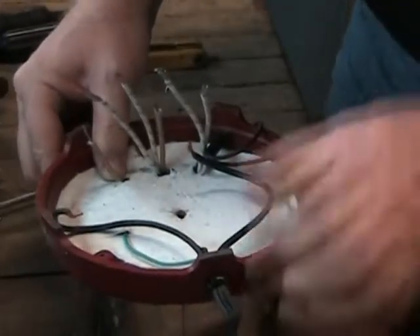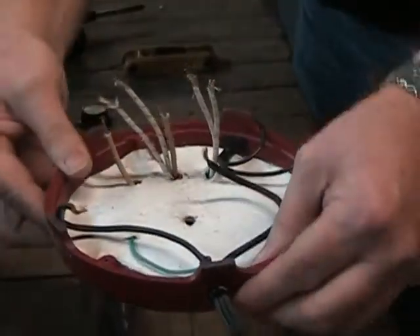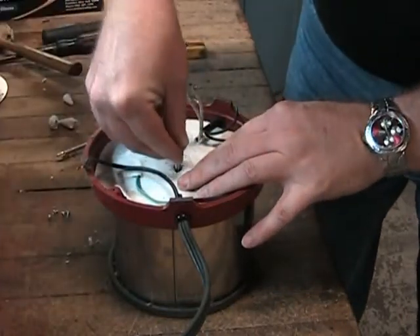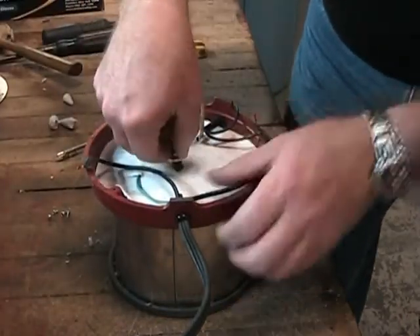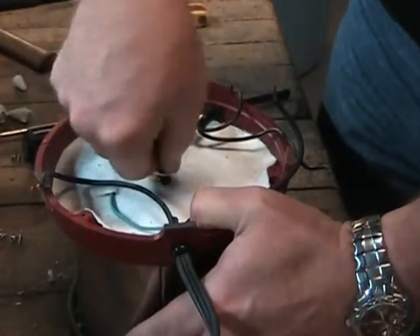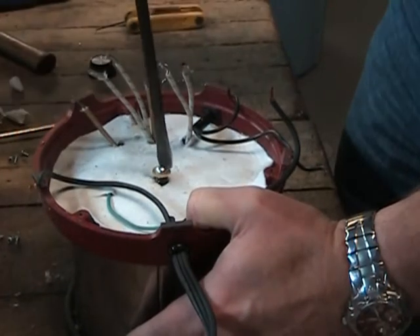Next you should verify that the lead wires have been fully drawn into the base holes and make sure the base is properly seated onto the casing ring. The main assembly bolt, including the spacer washers and tensioning spring, can now be put back into place. It is best to begin tightening by hand to eliminate the possibility of cross-threading the bolt. Using a screwdriver, tighten the bolt only until you have light tension on the spring.